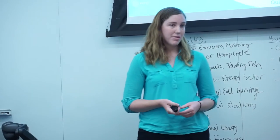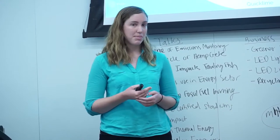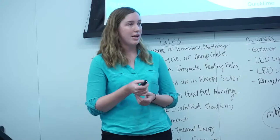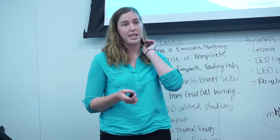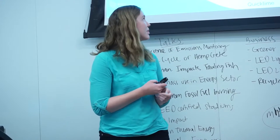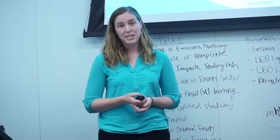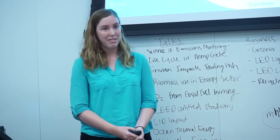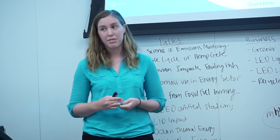The other resources involved in hempcrete are lime and water. The lime is made from limestone, which is heated to form something called quicklime, with the chemical formula calcium oxide. It is produced by heating limestone, which in that process releases some carbon dioxide. Limestone is a naturally occurring substance, but it is finite. Similarly, water is naturally occurring and finite, but relatively small amounts of water are needed compared to the amount needed for regular concrete.